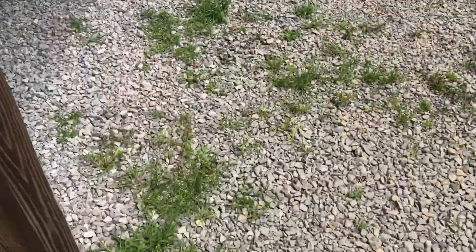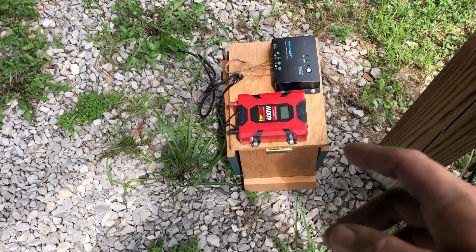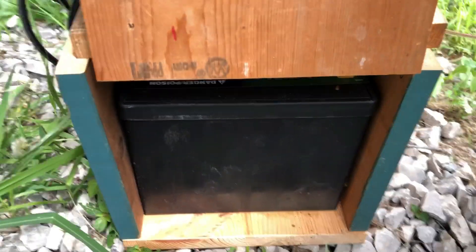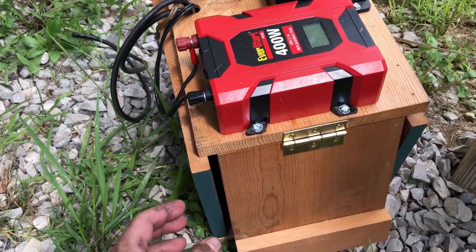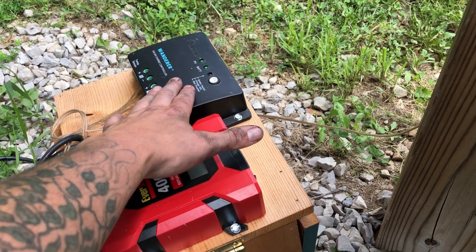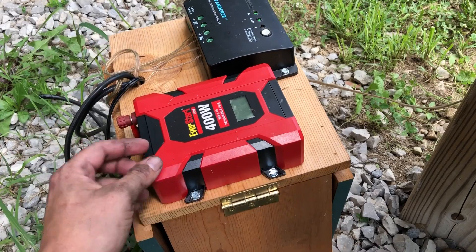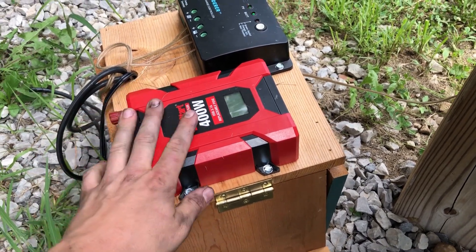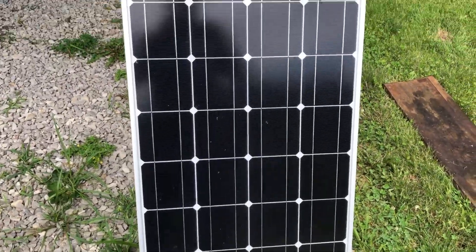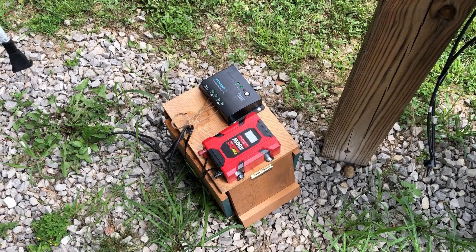It's going to go in this thing that got destroyed — unfortunately my wife kind of dropped it off the table. But inside there are two deep cycle batteries. Let me see if I can show you — you can see there are two batteries inside there. They're really small, and I made this box specifically for them, but it kind of got knocked off the table. The inverter I put on just because we're using it here, and the charge controller. Everything's full and this thing works great. The inverter is only 400 watt and it's modified sine, so it's only useful for like lights or something. And this 100 watt solar panel — all of this is going to be taken into the woods, sealed up nice and tight so the weather can't get to it, and I'm going to let it go and see how long it lasts.